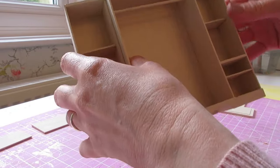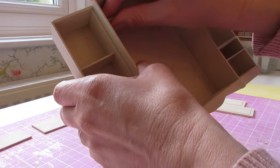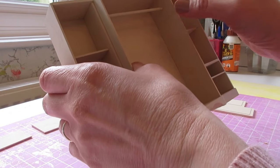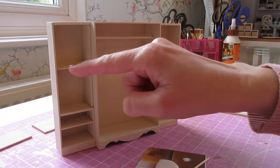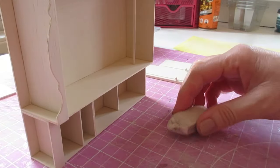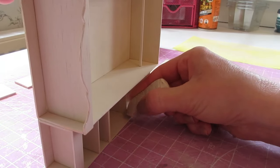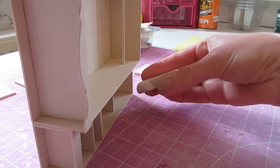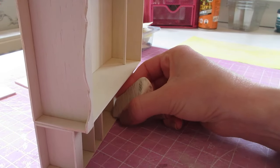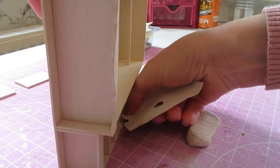Get it into place and have a look from the front to make sure it's sitting straight across there. Now we're going to get rid of these pencil marks. Lay the piece down and you can either use an eraser or a piece of fine grade sandpaper for this — I always start off by trying with the eraser and then if it doesn't come off I go in with a bit of sandpaper. Bring in a little bit of 500 grade and just sand along that edge.